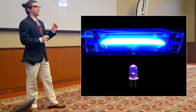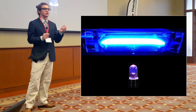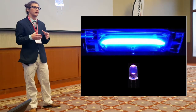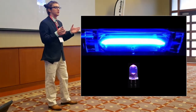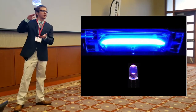But they have a drawback, and that's the price. They're expensive because of the slow manufacturing techniques that can typically only produce a few square inches at a time and require expensive crystalline substrates. I use a technique called molecular beam epitaxy to grow LEDs. It's not grow like plants, but more like stacking atoms like Legos.